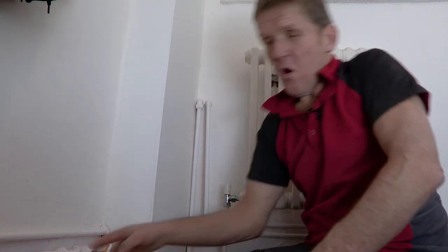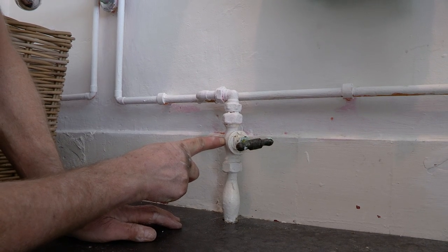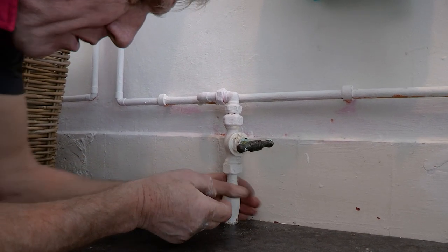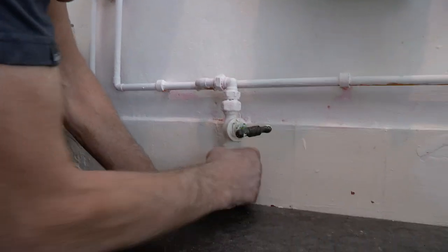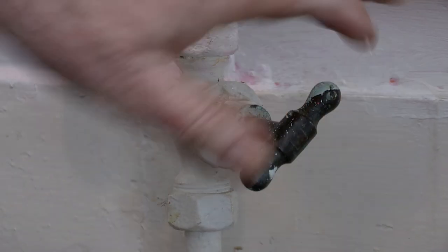Stopcocks are very hard to replace a lot of the time because they're stuck in pipe where you've got to find enough free pipe to get the stopcock out. Sometimes they're under a sink or stuck under the stairs cupboard. There's another one here - this is an old lead one. If this gland starts leaking, the chances of replacing that stopcock are very slim. You've got a lead joint which you don't want to disturb. If you do need to, turn it off in the road, undo it very carefully, because if you tweak that lead slightly you've got a gusher. Just undo the gland nut, slide it up, wrap it with PTFE tape, stuff it back in, and it'll be good for another 20-30 years.